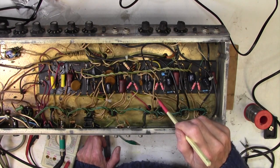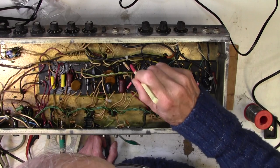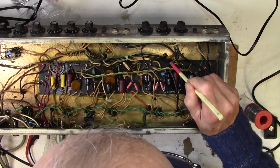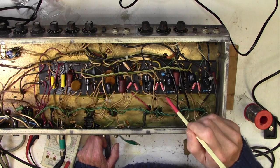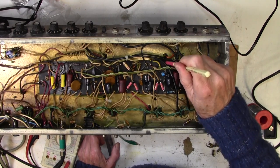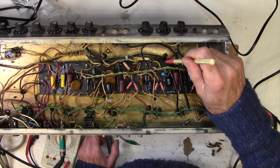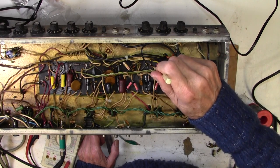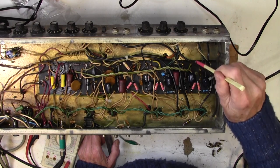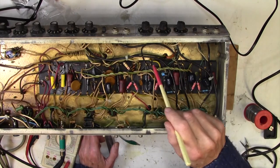So I think this is probably some feature of this board bowing. And that makes life very awkward actually. See, that's giving exactly the same symptom, so it's certainly not a faulty component. I'm just bouncing up and down on the board here, very lightly actually. Could be anywhere. Nasty. Now I can go over all these joints, but they all look fairly good to me.